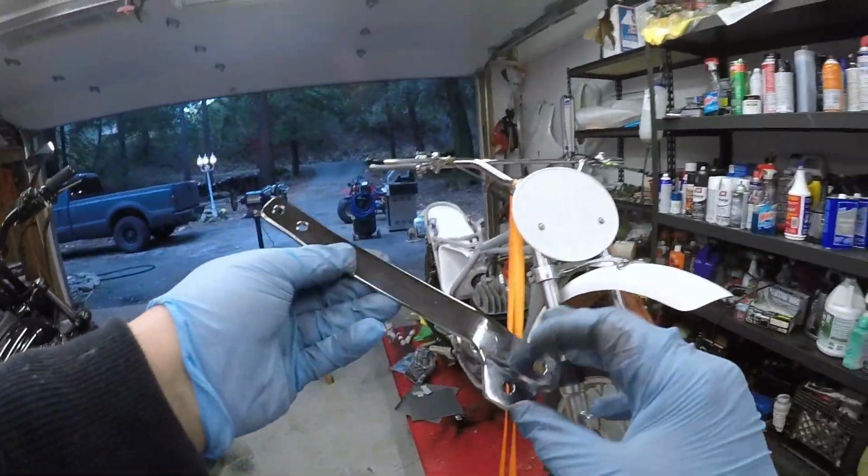Stoked on that. Alright guys, I hope you enjoyed that and it answers some of your questions. If you have any other questions, feel free to ask. But pretty basic. It just takes a little bit of time. When you're buffing, the most important thing is to not push too hard, and you'll know if you are because your piece will get really hot. But light pressure and let the machine do the work. That'll save you some time and effort.